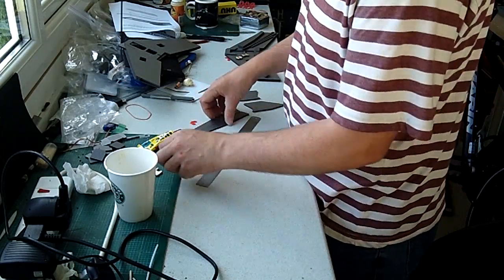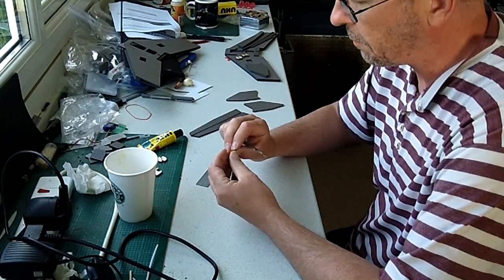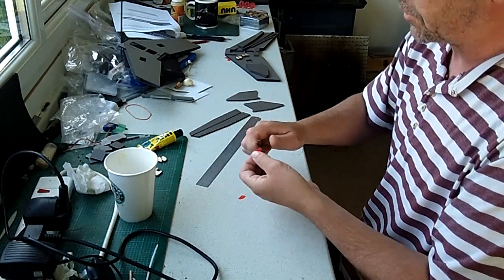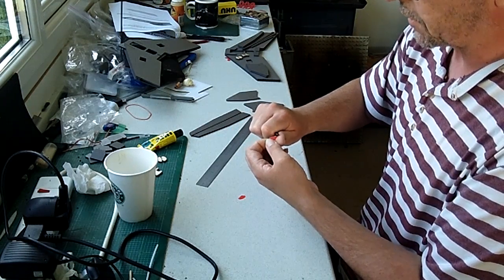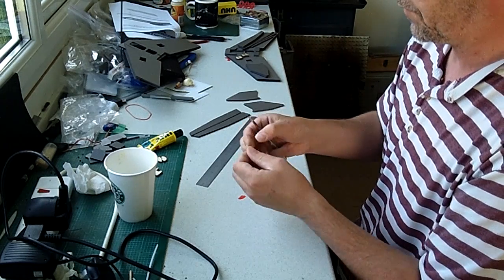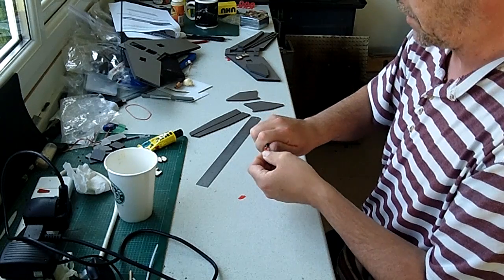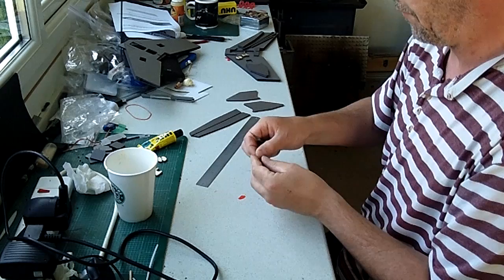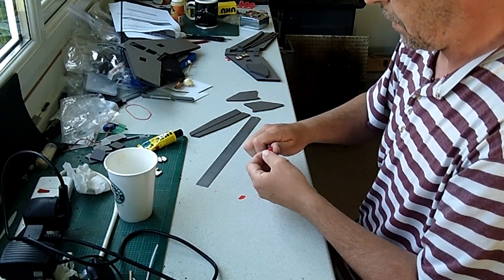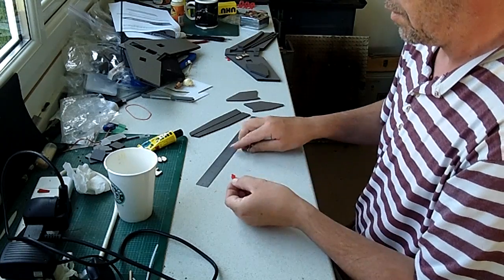The next thing is the two little horns. You might as well clean these up at this stage. When they come, because they're on the rapid prototyper, you get like a little overspread on them, which can be cleaned up if you just get hold of the knife and scrape it up the side using the craft knife, and this removes that little flashing, if you like. So that cleans them up just around the outside edge, as so. And then they're cleaned up.